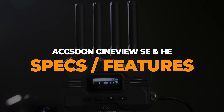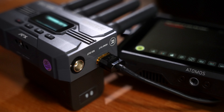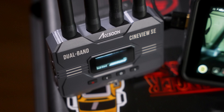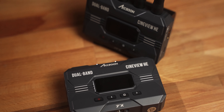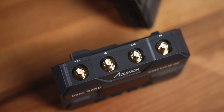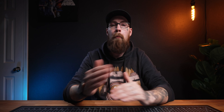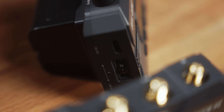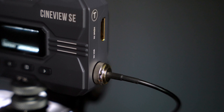Now let's talk about the specs — I'm going to cover both, since the only real difference is one is HDMI and one is SDI. The SE and HE receiver can receive up to four transmissions — phones, tablets, plugging into your camera, a TV, whatever you want, giving you four different signals. You're getting a 1080p 60fps transmission up to 1,200 feet. It has USB/UVC output and iOS and Android app support. It's got zebras, LUTs, and a 2.4 and 5 gigahertz dual-band frequency that automatically switches to give you a better signal. On latency, they're quoting 60 milliseconds. Other features include auto channel selection, group pairing, and a fanless design — I'll link the full specs in the description.